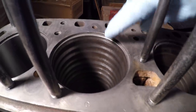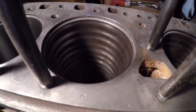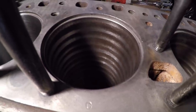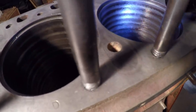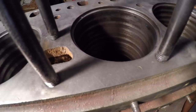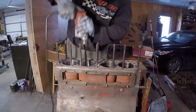You can see the shiny from the hone and the dark areas that look like tiger stripes in there. We took the bore gauge and we're finding about a thousandth difference in diameter between the shiny and the dark spot. The stones are picking up a lot of gunk until we get that cleaned out. It kind of looks like previously they did a retainer or something on the sleeves — there's a greenish tint in there. I think that's part of what we're picking up: some kind of retainer compound they put in to hold the sleeves. We'll do a little more honing and get back to our progress.